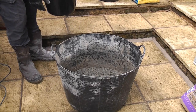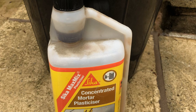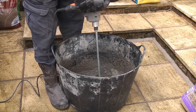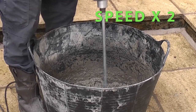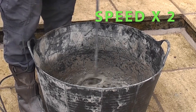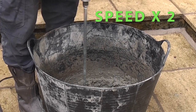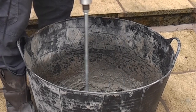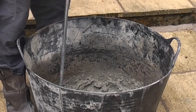Once you are certain that the ingredients are mixed fully you can then add some water. I've added a plasticiser to the gauging water following the manufacturer's instructions. This adds workability into the mix and makes the concrete much easier to handle and get a smooth finish. When adding the water ensure you don't add too much — you can always add more but you can't take it away. Now mix the concrete even more, ensuring you give it a really good mix. Once all the contents of the tub are thoroughly mixed, your concrete or granolithic mortar is ready to be used.